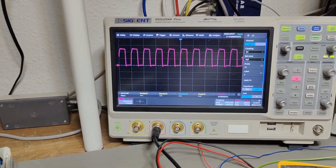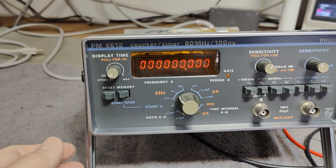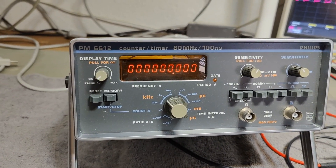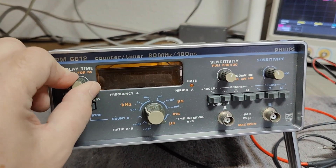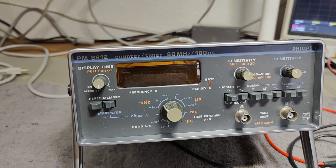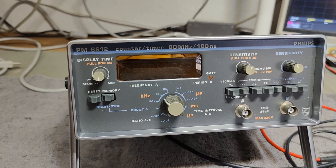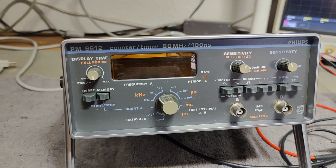The main oscillator is running, and it is definitely an oven because it's getting really nice and warm. Now the power consumption is much less — it's 8 watts when first turned on and only 3.5 watts once it's warmed up. So that is the oven, now nice and warm and stable.